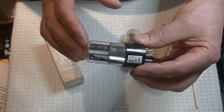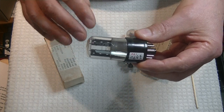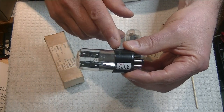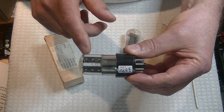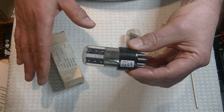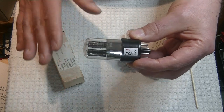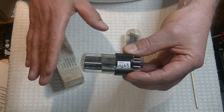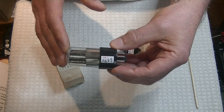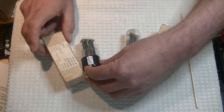What's the difference between a 12SN7 and a 6SN7? It's just the filament voltage required to light it — that's it. Because the filament slides up and into the middle of the structure, it's easy at the manufacturing point to make 6SN7s or 12SN7s; all you have to do is change the filament. Everything else, I believe, is absolutely identical. Now, do the 6SN7s and 12SN7s sound exactly the same? No, there's a very small difference. I would give the edge, actually, to the 12-volt versions. And someday, maybe we'll talk more about that.